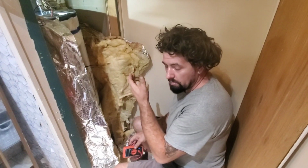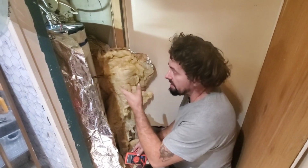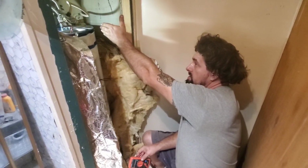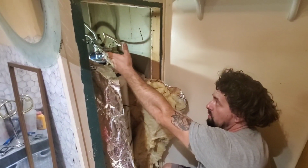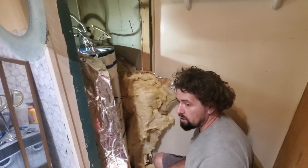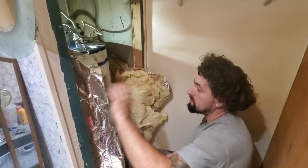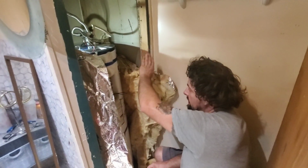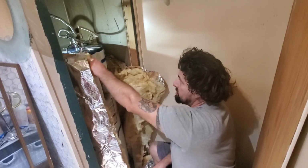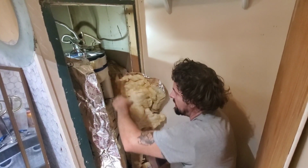Okay, well, hey neighbors, welcome again to the moldy, dilapidated trailer bathroom, the worst part of the house. We got the hot water tank back into the house. We've hooked our supply line up to the house, and now we have filled our hot water tank. What we did, as you saw, is we opened the valve to our hot water supply to the house and allowed water into the tank, because the water goes down to the bottom of the tank and then pushes all of the air out of our line into our bathtub, as I showed you. That way we don't have any air in our tank.